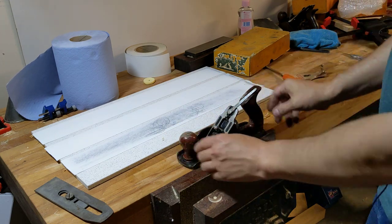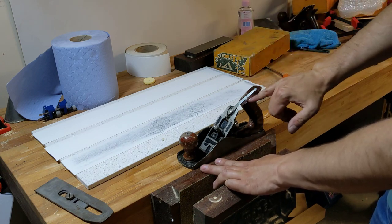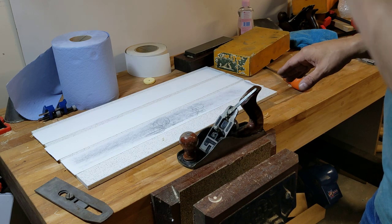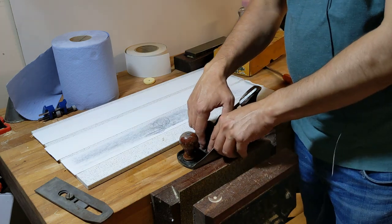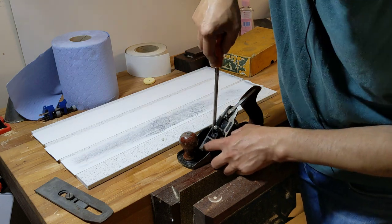Sometimes on the knobs and the handles, what can happen is the material can shrink. Try and do it up and it just bottoms out. There's a threaded rod in there. Just take it out, trim off a few millimetres, a quarter of an inch, or an eighth of an inch. Put it back in. It's going to pull it down nice and tight. Feeling the frog. He's a little bit skewed in there, a little bit too far forward for my liking, so I'm just going to slacken that off.